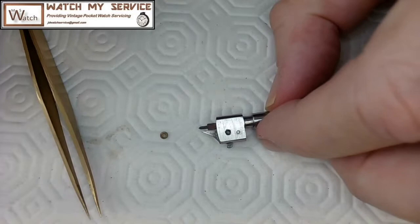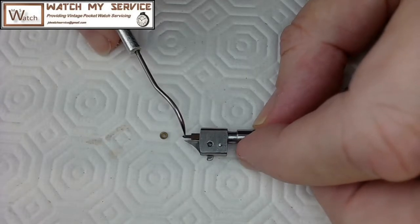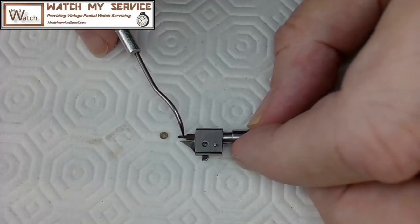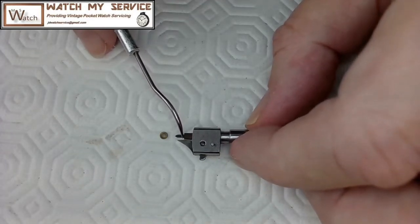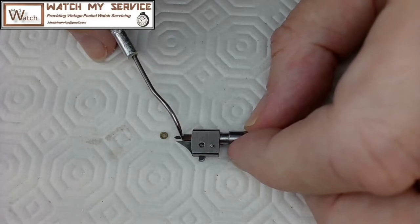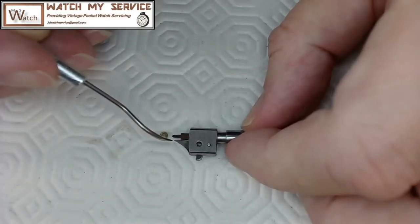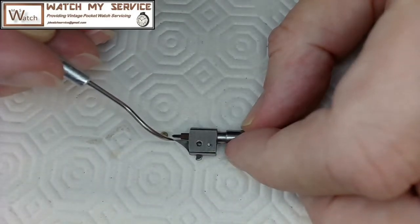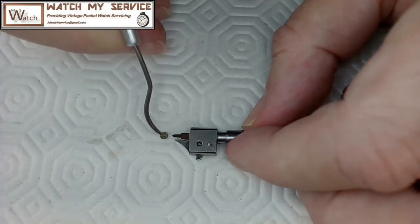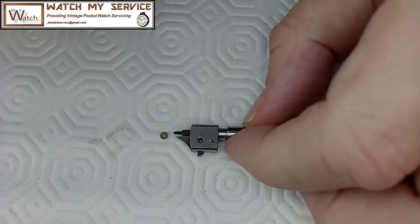The new tool allows you to cut the hole back deep into the brass rod to a certain depth, keeping it absolutely flat on the end. That cuts the initial hole. Then this other part of the tool cuts the groove that you fold over the jewel to keep it in place.